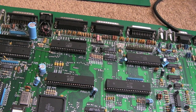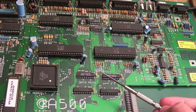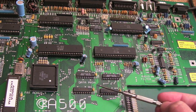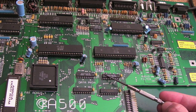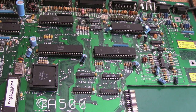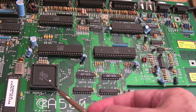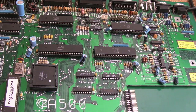The data path sits between Agnes and the CPU, from what I can see in the schematics, though there might be other things on the other side as well. You've got two 74244s which are just buffers, and then the bottom ones are 74373s which are latches. I'm guessing it works similarly to how it was done in the Neo Geo - the CPU can write to those latches, do other things, and then Agnes can pull the values from those latches.